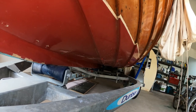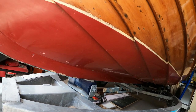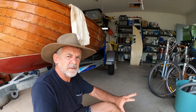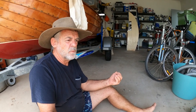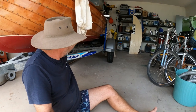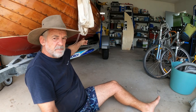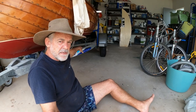A tiny little bit of leakage is always forgivable, but what you don't want is so much water coming in that you're spending half your day pumping. None of these joints are glued — there would be a bit of paint and varnish that's gone into the joints over time. I did run a fine seam of Sikaflex along here on the joints between all the planks below the waterline, and then painted it with solvent-based, good old-fashioned turps-based enamel. So don't fiberglass. You've got to work with it rather than against it — work with natural products and natural processes, not against them by trying to use some chemical solution.